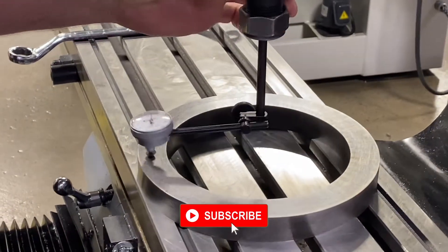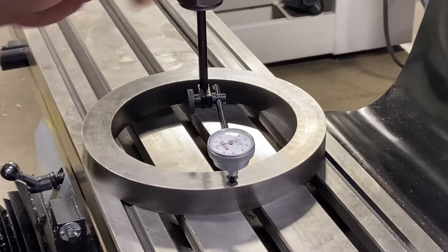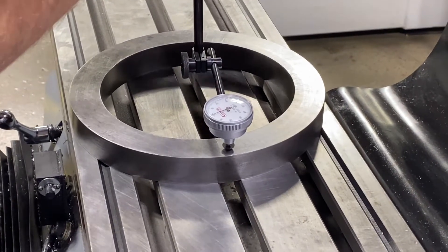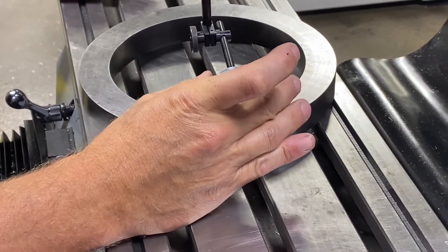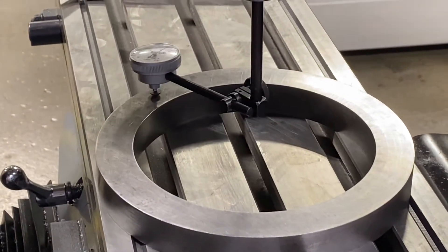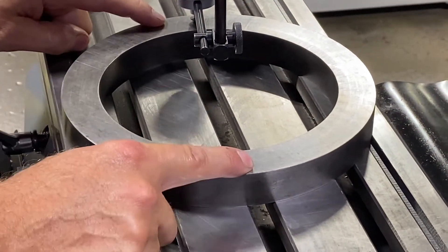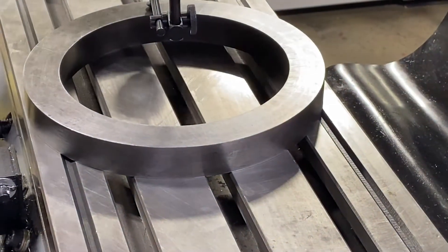I'll come back over to this side and to counteract the negative movement, I'm going to go negative on this side just a couple of thousandths of an inch, very slightly. I'll read zero again, then sweep it over to the other side — and I'm reading exactly zero on the left hand side. So I'm zero and zero, this side and this side. Now I can start working the tilt of the tool head front to back.